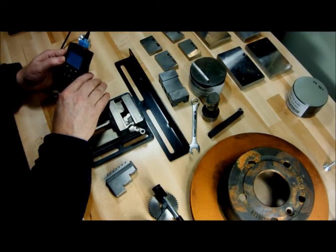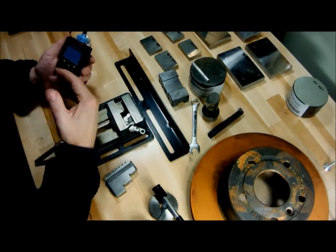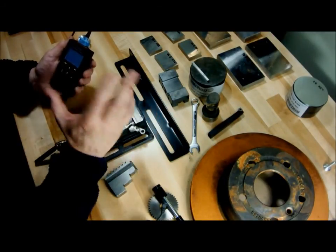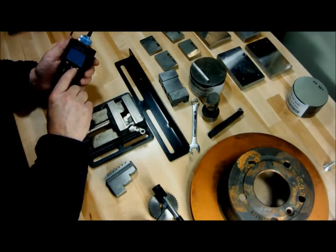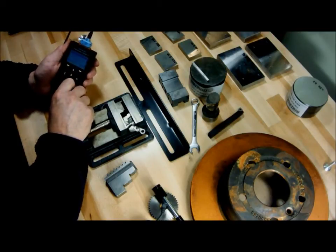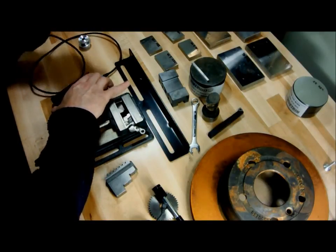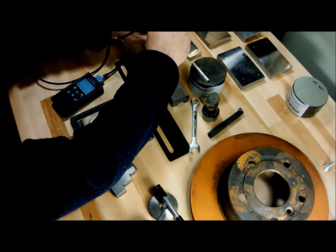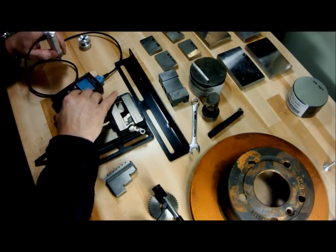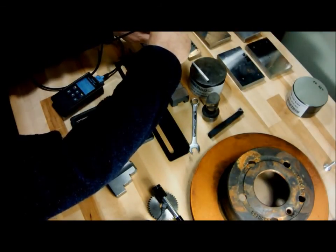There are many companies that make test blocks that are NIST-traceable, and our whole philosophy is to supply products at the lowest cost. If we had to inventory blocks that could be bought from other manufacturers in the US, the cost would go up — it's really best that you just buy from those directly. So if you wanted to do testing for your own particular steel type, you could have a piece of material calibrated, know what its hardness was, and very quickly calibrate the tester to that material.